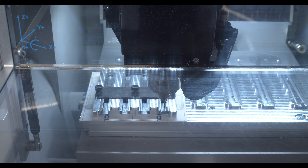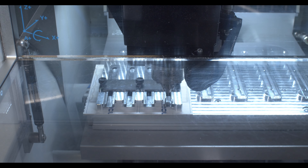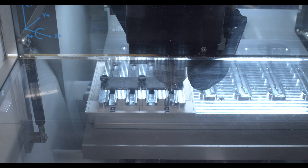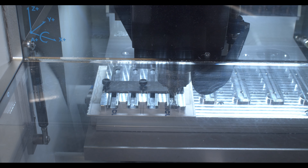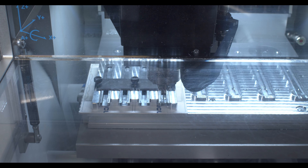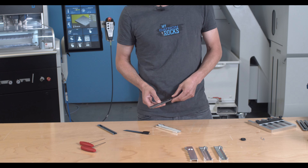That's why we've made this little fixture here and already pre-drilled a couple of these. This is just a clamp — it holds four of these rails at a time. We machine them with a double flute end mill and at the end we have two bores with a little chamfer.